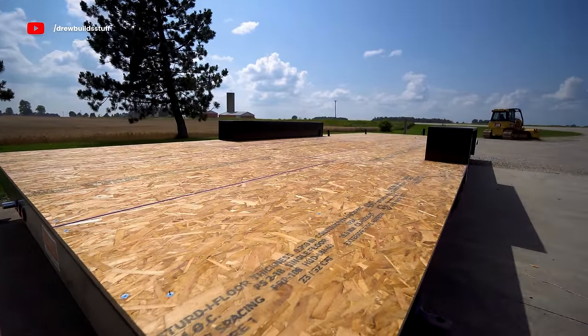With the door all functioning properly, I just put in a roofing nail into this nailing flange every foot or so around the frame. And then I flashed up both sides and the top of the door. And added that metal drip edge and overlapped the house wrap the same way I did on the windows.